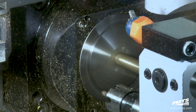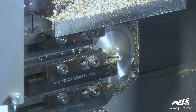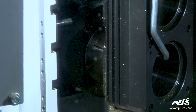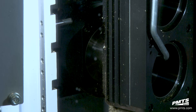One of the nice things about having a B-axis to be able to adjust your helix angle is when you're trying to tweak in the actual thread form of an orthopedic thread. Instead of having to manually adjust it to get the right clearances on the flank angle and lead angle of your threads, it's merely just an offset or a program change.